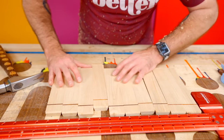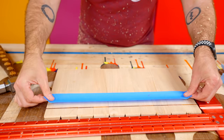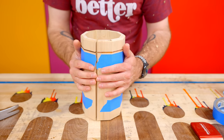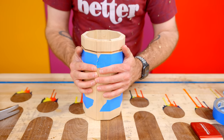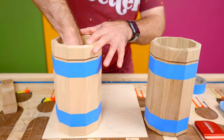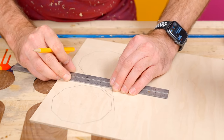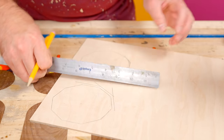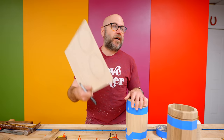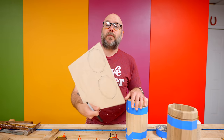Use a straight edge to line everything up, then use some painter's tape along the outside to hold everything together, coil it together, and tape it shut. This allows us to draw our bottom. I've got a piece of one-eighth inch plywood that will fit into the groove made earlier. Here I'm drawing the inside dimensions — which would be too small — so I offset that with a ruler, eyeballing it and making it a little bit bigger. Then cut this out with a coping saw, jigsaw, or bandsaw. You don't have to be precise because it's going to be hidden in the groove — close enough is good enough.